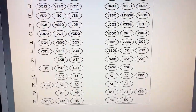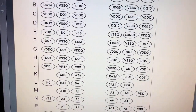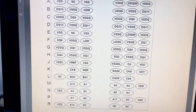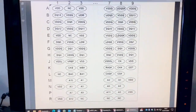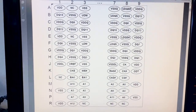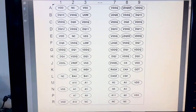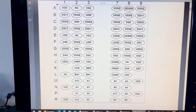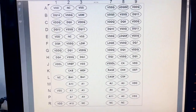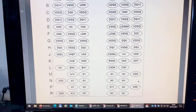And of course there's a BGA — these are tricky to solder by hand. You can only do it with hot air, and even then it's quite difficult because you have no way to see if the pads and balls are correctly soldered. There are a few techniques I use that work for 99.999% of cases, but these things were never intended to be soldered by hand.